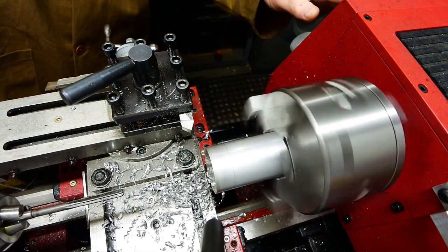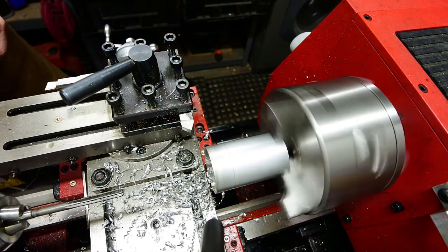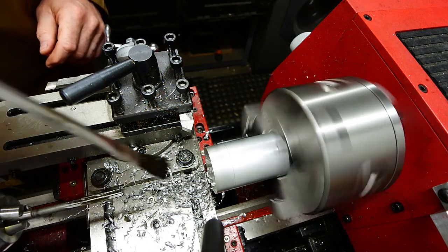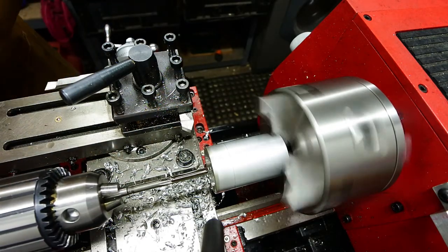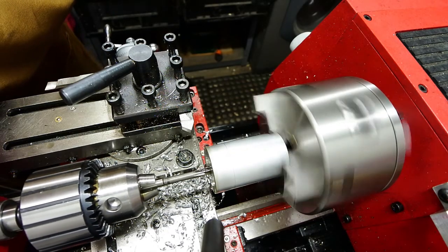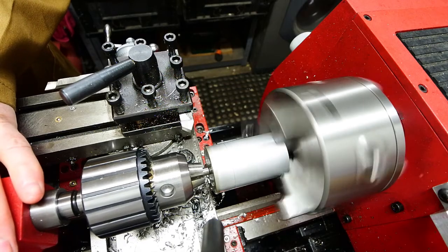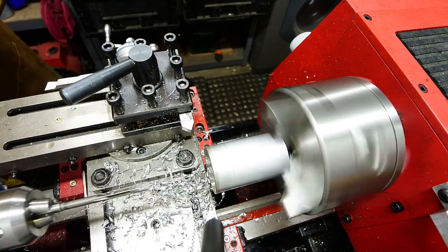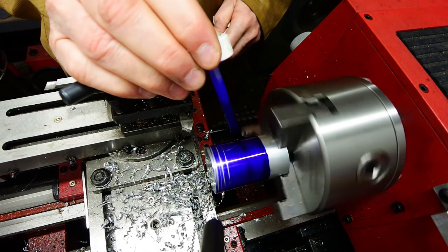And then use the cheapo 6mm reamer. I'll lubricate that up good and proper as well, run it very slowly, and I'll just push that in by hand, just get it through and not give it a chance to seize in there. Satisfactorily, that will be a 6mm hole.